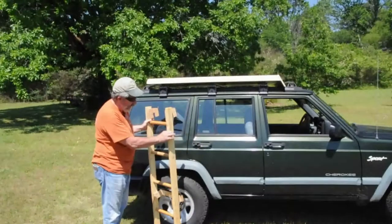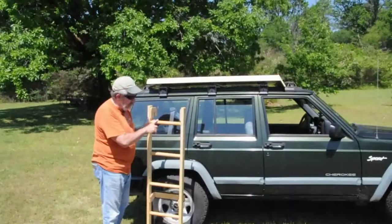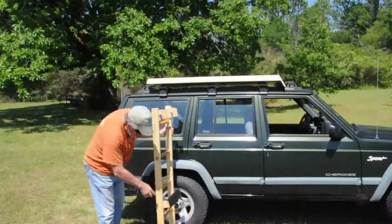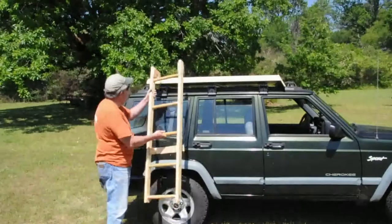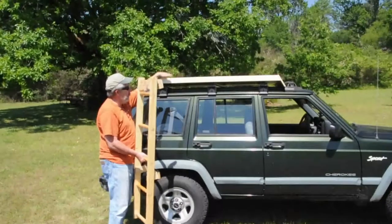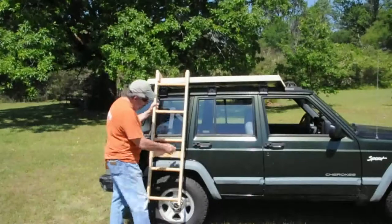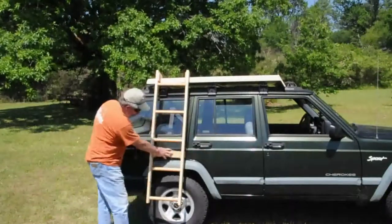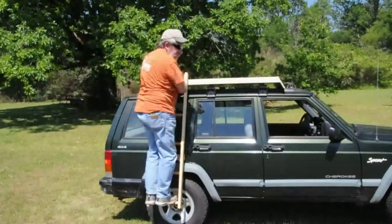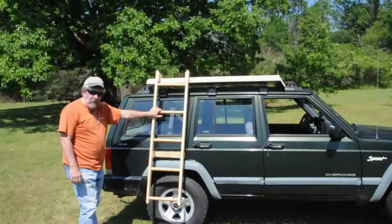This is some 2x4 pine that I trimmed down, ran through the planer and jointer, squared them up, and got them thinner since I didn't need them that thick. The rungs are closet dowel rods — I had all this stuff in the shop. I used some Baltic birch scraps for slots that hang over the edge, and made a little brace. It hooks right over the edge, and what you can't see is this edge fits flush on the bottom, not on the rail — so most of the force is pushing down, not trying to break that rail over. It clears my door, has a little carpet pad that sets against there, and you climb up no problem. This would be just a few dollars to make, but I spent a lot of hours thinking about how to do it.